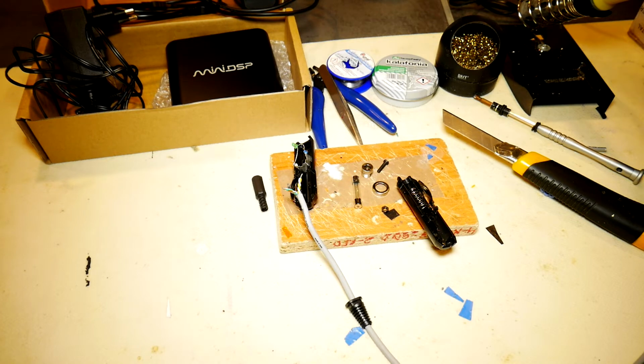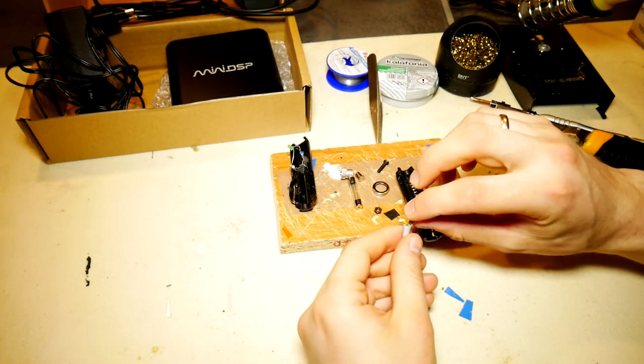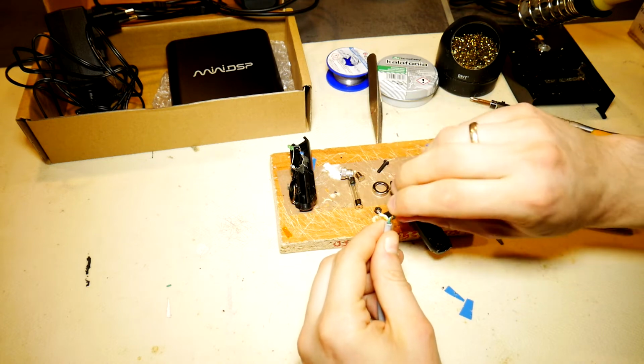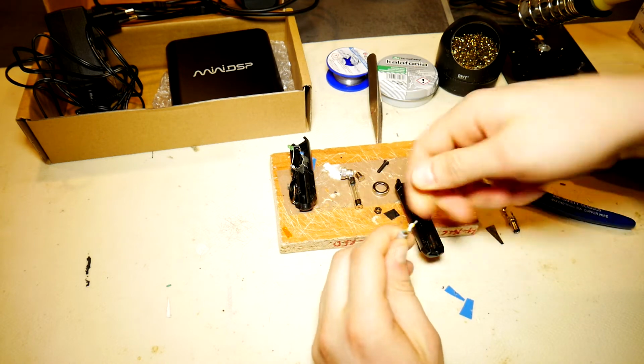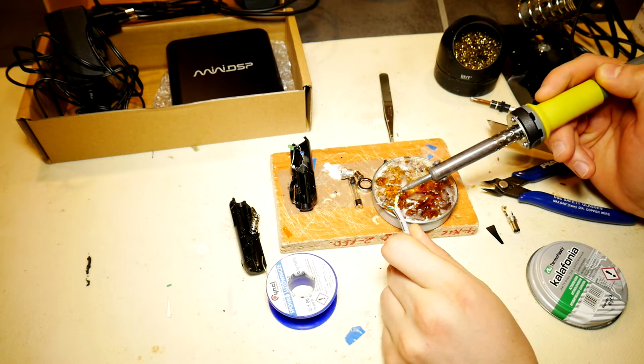Then on the cable we need to put a cigarette lighter plug's cable protective rubber. Then at the other end of the cable, twist all cores in the same way. But it's very important that same colors at the both ends are twisted together. Otherwise you'll get short circuit and rest in peace car fuse. Then tin all 4 cores to make it easier to solder this wire to connector contacts.